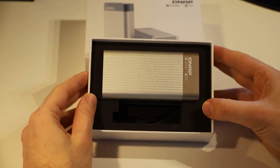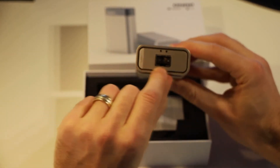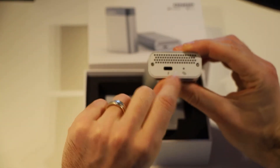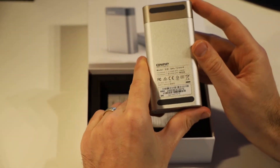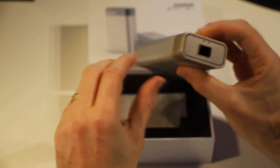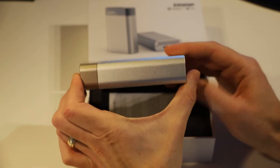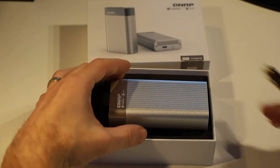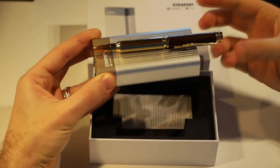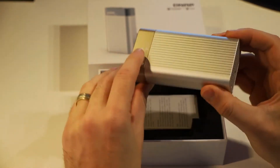It's pretty straightforward in here — we've got our actual device, and you can see there that's our SFP input, and on the other side our USB-C Thunderbolt 3 connector. It draws 3 amps at 5 volts, so whatever device you're plugging it into needs to provide that much power over the Thunderbolt connector. It is a decent size device — just for reference, here is my pen, and you can see it is almost as long as a normal-ish size pen, so fairly big device.